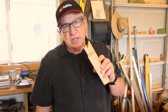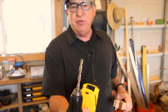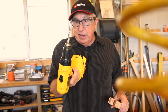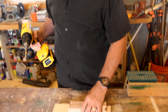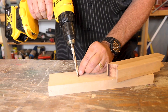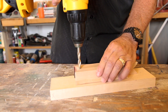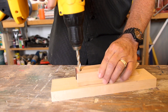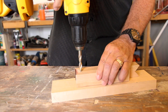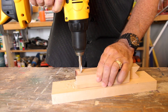Alright, let's go ahead and put it to work. I'm going to go ahead and use just a three-eighths brad point drill. Let's suppose that you were doing a bench top and you needed some hold downs or some threaded inserts, and you wanted to make sure this was absolutely perpendicular, not going wonky. So what we're going to do is place the tip first, place where you want the drill to begin with, then bring the guide up to it and encounter both sides. This stops you from going off-angle. It automatically trues it up, and then go ahead and start — and you can see it's keeping me very clear.